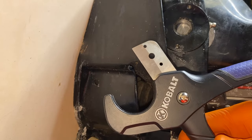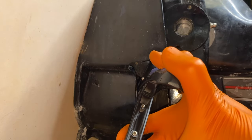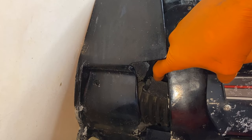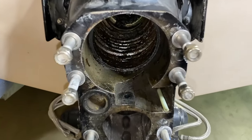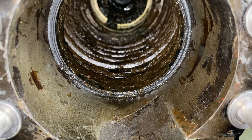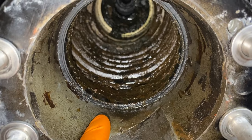Repositioning the camera — shifting the bell housing starboard opens up the gap for better access to the water tube. With the blade on top, I'll apply friendly pressure to cut through it. It is now completely cut. For Alpha 1 Gen 1 owners, we do not have an internal locking ring securing the U-joint bellows to the bell housing. However, Alpha 1 Gen 2 and Bravo engine owners do have that internal locking ring, which must be removed at this point.